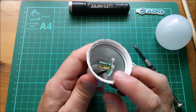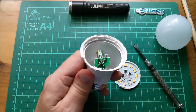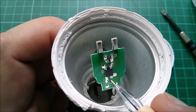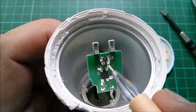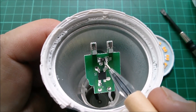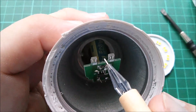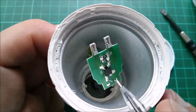Let's try and get this plate PCB out of the lamp and see what's underneath. We've certainly got a large capacitor there. Have we got the bridge rectifier? Yes, it looks like we have. In here there is a four-diode bridge rectifier — the four diodes are integrated into one package.